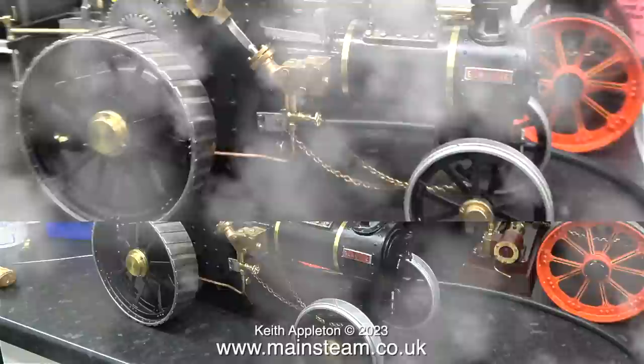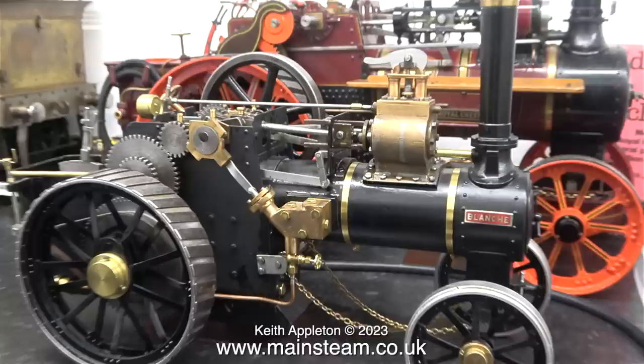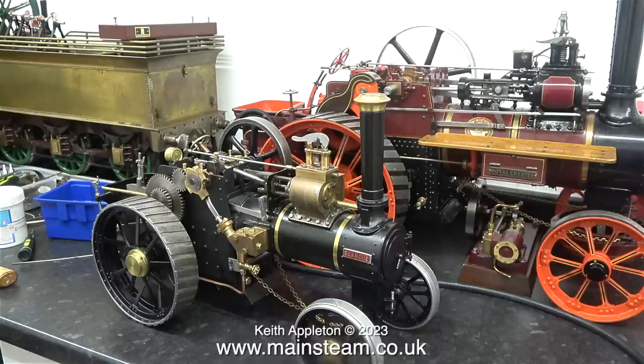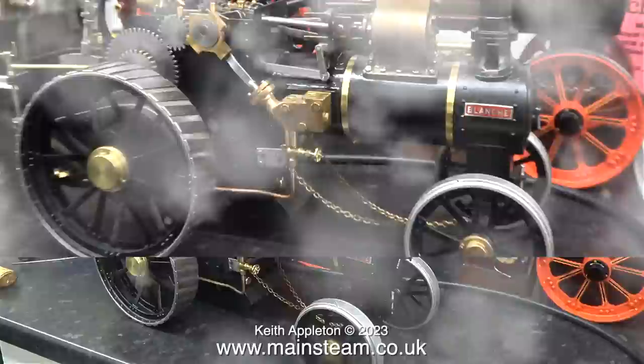This one, on the other hand, in my opinion is scrap. For some people it may be okay as a static ornament, but for me form follows function, and as this doesn't work it has no purpose — I would not want it as part of my collection. A final thought: if you're considering buying a traction engine or a steam locomotive above the size of a small steam toy, it's very important to make sure you have paperwork with the boiler, even if it's expired — it's better than nothing.